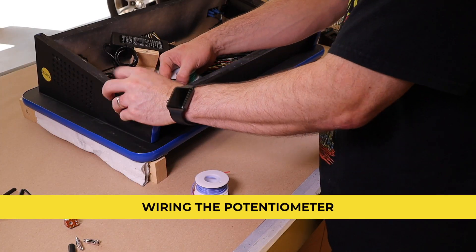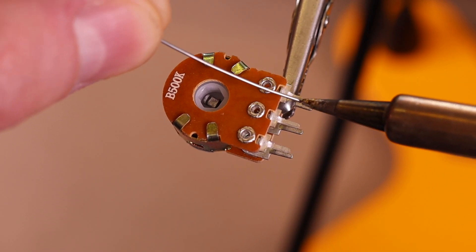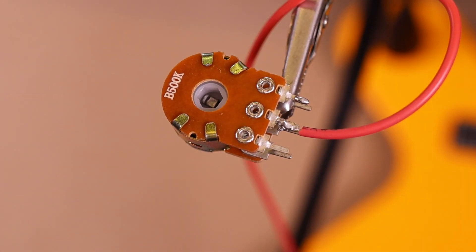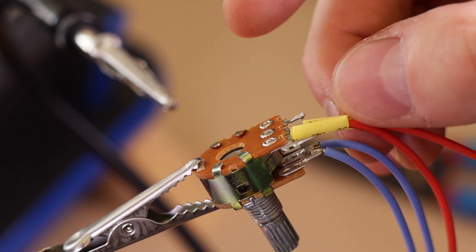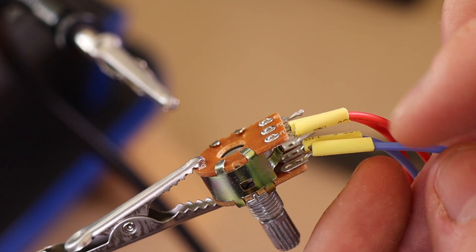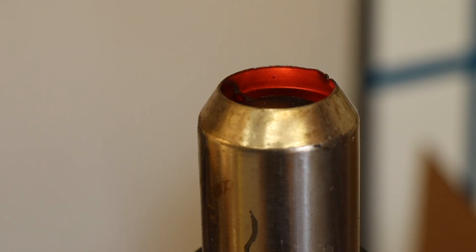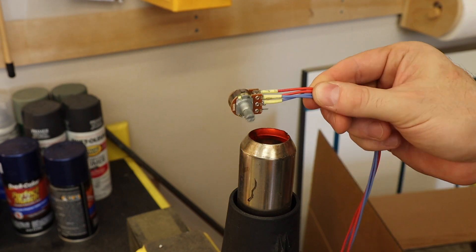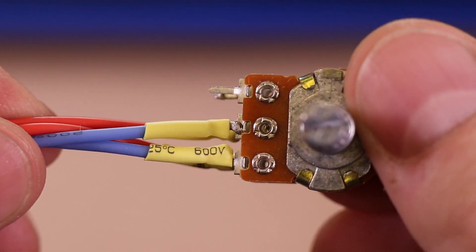Next, we need to cut out five strips of wire — four for the stereo channels and one for the ground. I tin the leads of the potentiometer and attach the stereo channel wires to it: red for left and blue for right. I then covered all four terminals with heat shrink tubing to protect them in case they ever accidentally make contact with something. I clamped my heat gun in a vise and fired it up — just slowly turn the tubing over the heat gun for two to three seconds. Using a heat gun is the proper way to shrink tubing and won't damage it like a cigarette lighter.